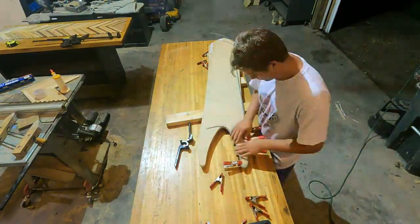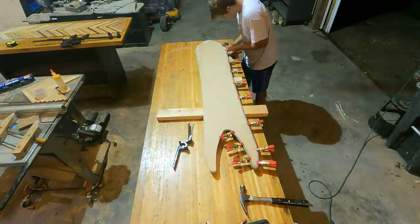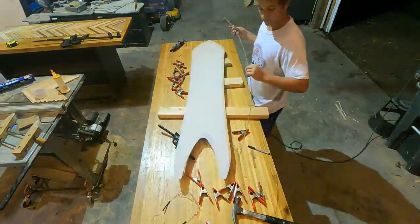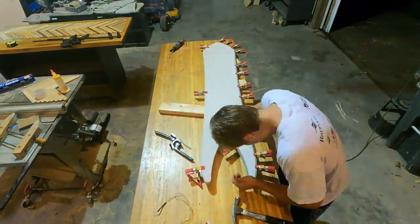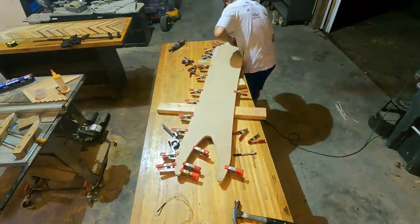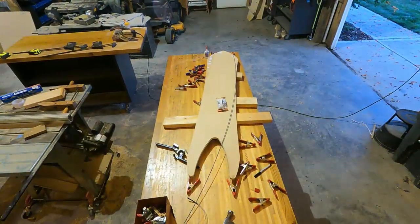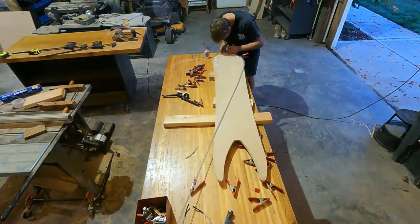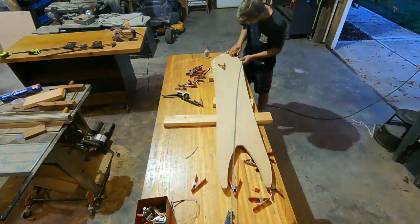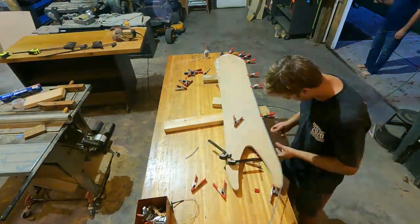It's pretty important to take your time with these and get them as close as possible. These tight turns drove me nuts — they were so tight that I broke a couple edges. I found that heating them up with a blowtorch really helped with bending. I didn't record that part because I was just too frustrated. I also accidentally bent the same side twice and had to go back, unbend, and re-bend that edge.